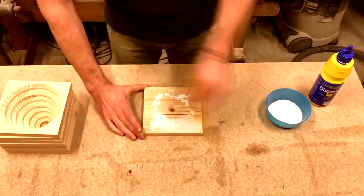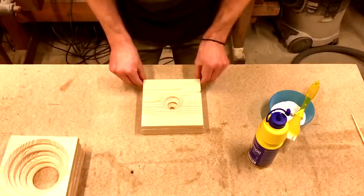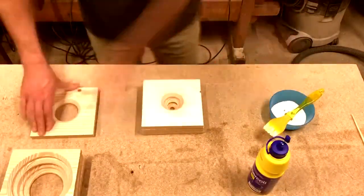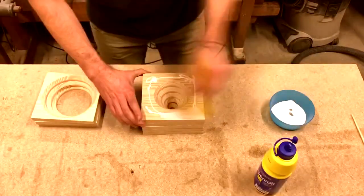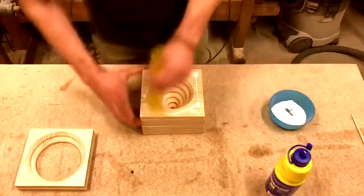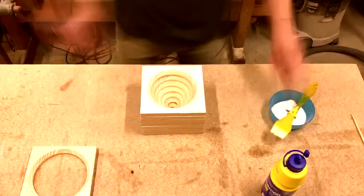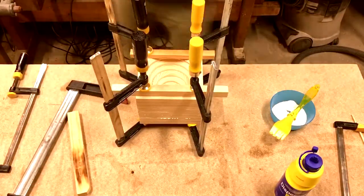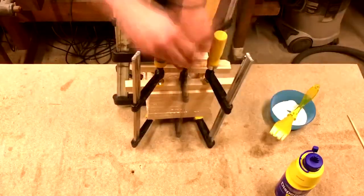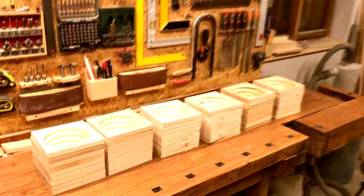After I lay on a layer of glue on the wood and spread it out, I always add a few drops of kitchen salt so that when the layers are pressed against each other, they don't slide and they hold the position I clamp them in. The salt is great for this purpose because it holds the pieces when gluing, but after that it dissolves in the glue so that the crystals are not present anymore. Finally, all the amplifiers are glued together.